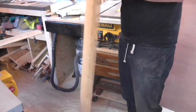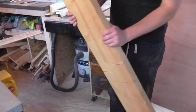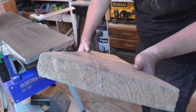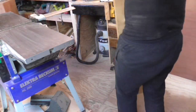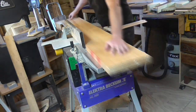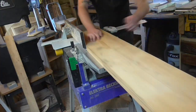It was time to start making a top for the chest of drawers and I was keen to use solid wood for the top. I had some salvaged pine in the workshop — one piece was about 20 centimetres wide and about 40 millimetres thick. It had a crack running about half the length of the board, which is probably why the reclamation yard let me take it away for free, but I'd glued and clamped it a while back. It was badly bowed in the centre, so I ran it through the jointer with the concave side facing down, making multiple passes until it was perfectly flat and smooth on one side.